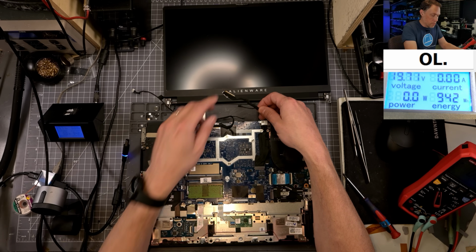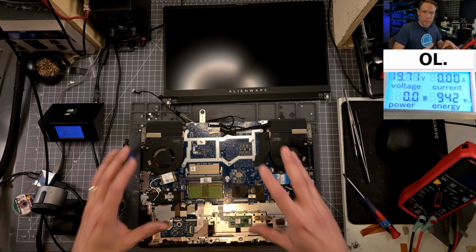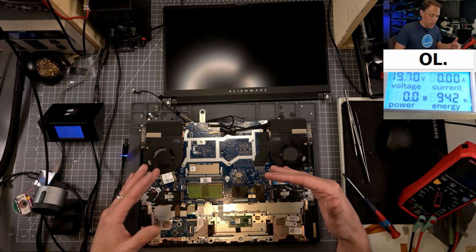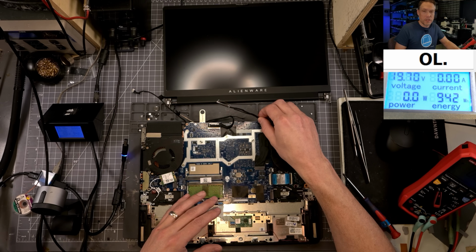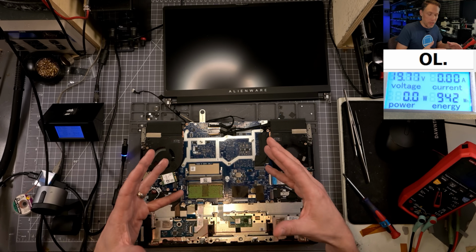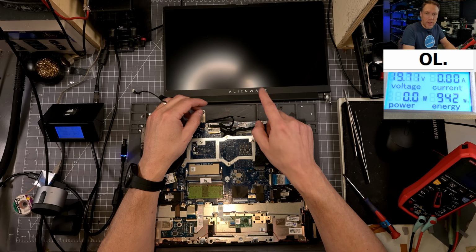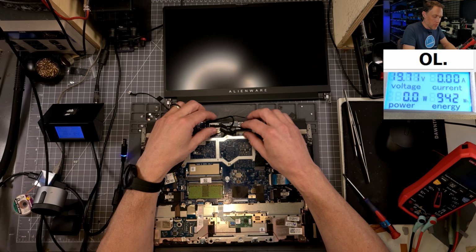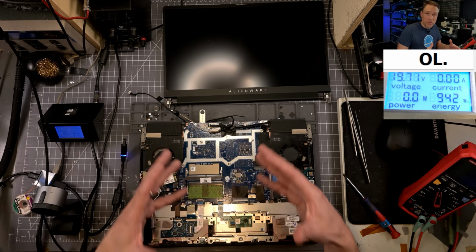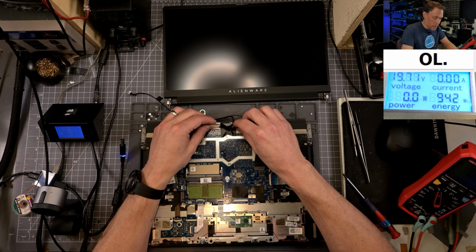I'm kind of suspecting that, you know, this laptop had a bad BIOS. So somebody had worked on it, took it apart a few times, and probably ended up damaging the LCD connector or cable or something like that, you know, while they're working on it. So it's either their LCD cable's bad or their screen's bad. I think I have these full assemblies. I can just sell them one of those and we can bolt that on there. Because they didn't have to replace the motherboard, that's saving them a lot of money. And so we'll probably end up having to do that.